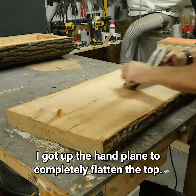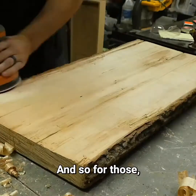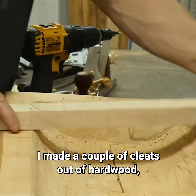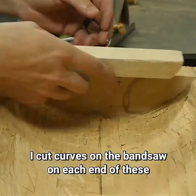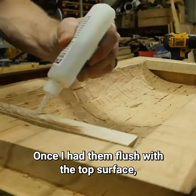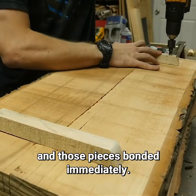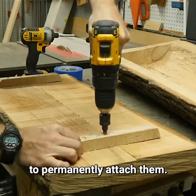While the paint dried, I got out the hand plane to flatten the top. I didn't fully flatten it — there were some areas that were pretty low, so for those I used an orbital sander just to round them over. You're just going to be sitting on this, so I really just wanted to smooth it out. To hold the seat panel in place, I made a couple of cleats out of hardwood to attach to each end, cutting curves on the bandsaw so they would fit down into the cutout I'd made on the inside of the log. Once they were flush with the top surface, I added CA glue to them and activator to the seat, carefully lined it up, and set it down — those pieces bonded immediately. This glue just held them in place while I pre-drilled holes and drove in some long screws to permanently attach them.